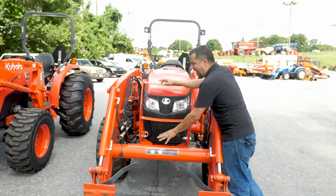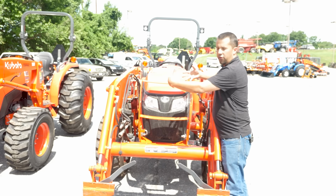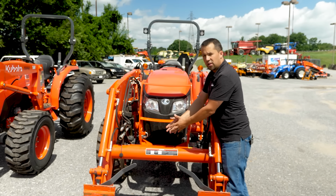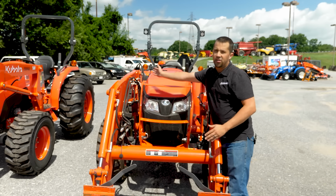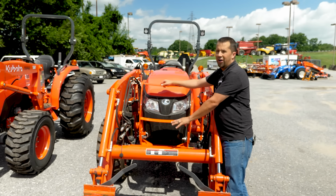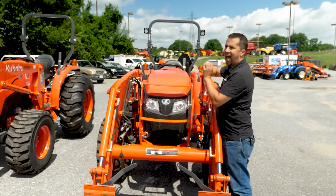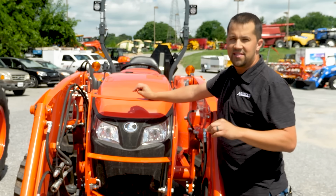The pros of having a diverter valve, there are some, is that when you remove the loader from your tractor, most of the diverter, the valve, all the hoses and everything stays with the loader. It's much more of a self-contained setup. What feeds back to your tractor then is very simply only a wire in order to operate that diverter. You don't have extra hydraulic couplers to unplug from the tractor. You only have the four that go back to your valve. That's the OEM setup in some cases.